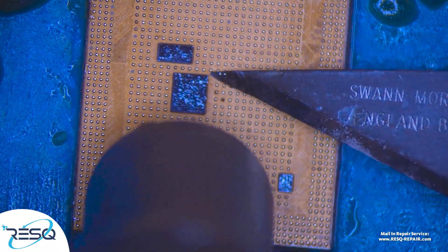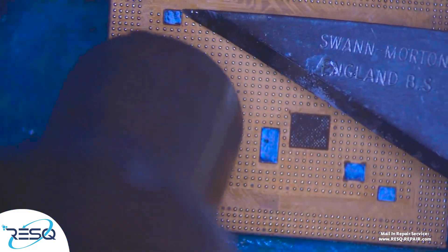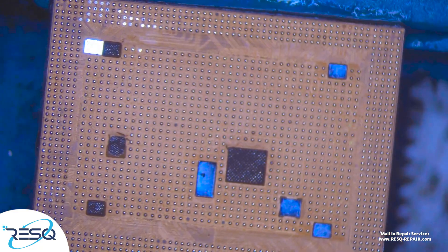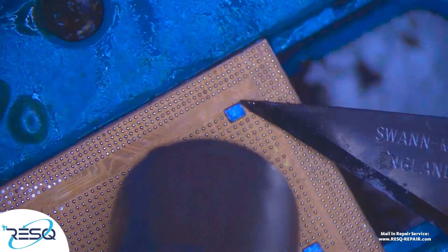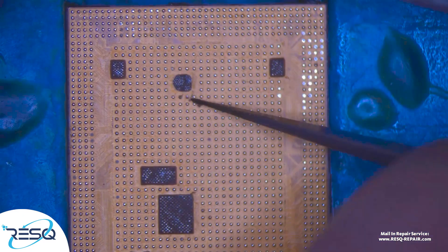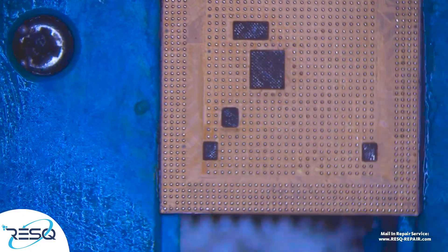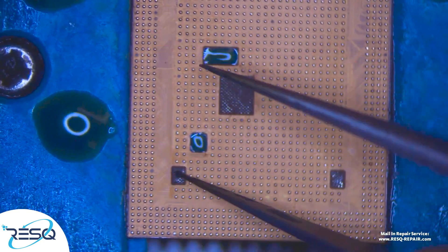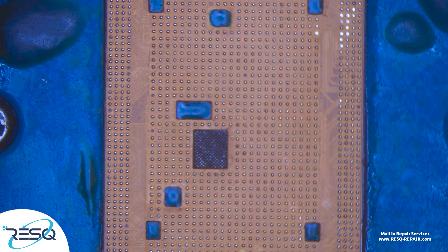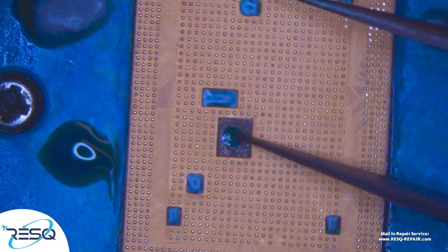The CPU is almost prepared. We often get problems with high boot voltages because of the deep trench caps. We always take the deep trench caps away on the newer CPU generations, then apply some UV solder mask on the deep trench cap pads, use UV light to seal it, and after that we are ready to re-ball that beautiful A16 CPU.